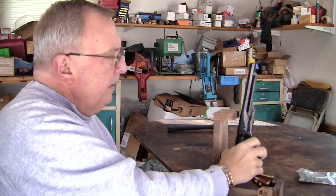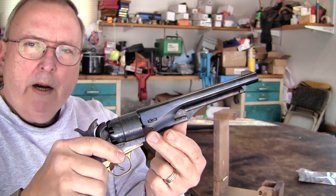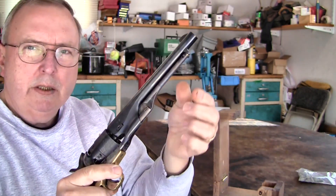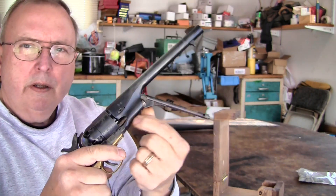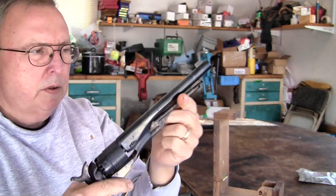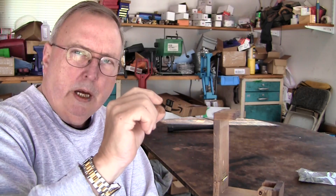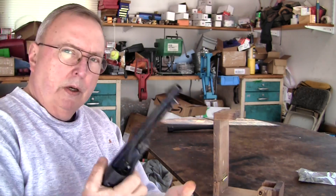On this pistol the shape is cut out, but it's not formed. You're going to have to modify it so the bullet can get around — you're going to have to sculpt it a bit. The second thing is the ram. When you pull down the ram here, this piece comes and rams the bullet. It has to be cut out to form the shape of the pointed conical bullet. Most of them are just a simple short concave for a round ball, and that's going to interfere with the nose of the bullet. Those are the two things we're going to work on.